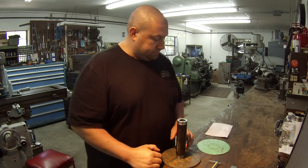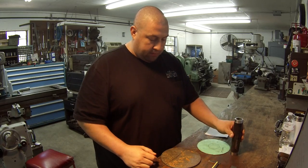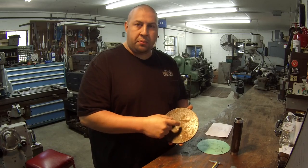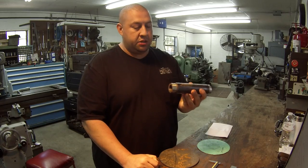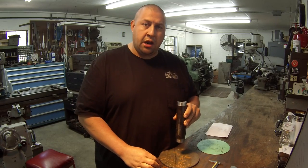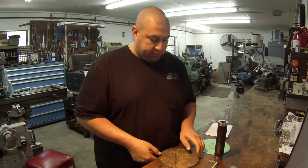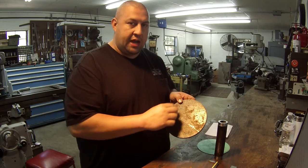This has got to be five inches long, so I've got plenty of material - I can part this off, clean both ends up. I'll chuck this plate up, bore it, and machine a weld prep on both sides - put a little V there. Then I'll turn this piece and it'll basically look like that. We'll have a little turned section that I can press it into, giving it a light press fit to keep everything nice and straight.